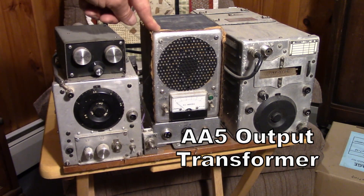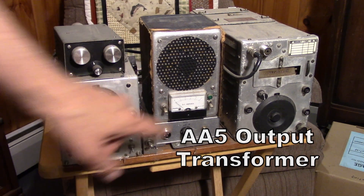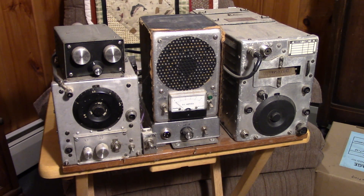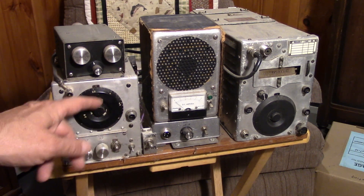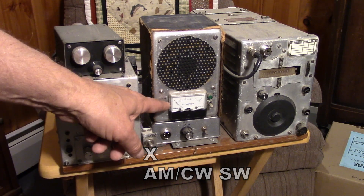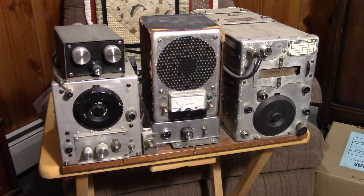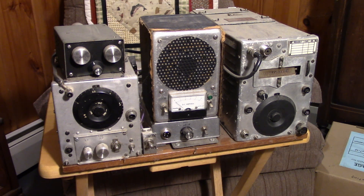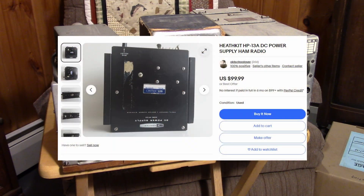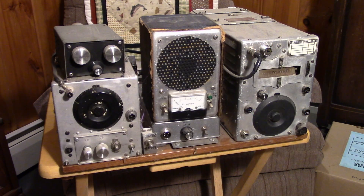In the middle, I have the speaker with a built-in transformer. There's a spot switch which turns the oscillator portion of the transmitter on and allows you to set the receiver. This is the power on-off switch, which actuates a relay and starts everything running, including the DC power supply, which is a converted Heathkit mobile supply. The Heathkit supply makes basically 800 volts and 200 or 300 volts DC. It's been modified so that the 800 volts is more like 420 volts, by converting the voltage doubler system to a full-wave bridge, which halves the voltage and doubles the current — just what you want for AM operation.